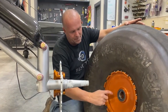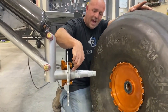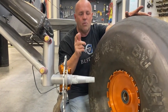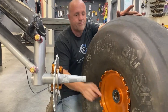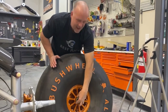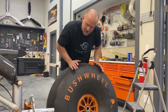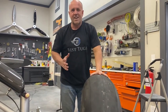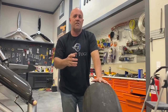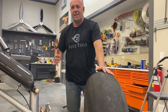But this double layer seal compresses around this step. And so on this side of the wheel, we have two layers to keep all water, moisture, everything out with that super tight seal. And on this side, to keep the moisture out, the cap has an O-ring in it. So there's nothing like this. I'm so impressed. It's more like automotive modern day stuff where you want to put it on and run it for a couple hundred thousand miles, turning indefinitely. So it's really neat to see it migrate into the aviation world.